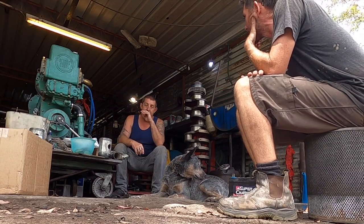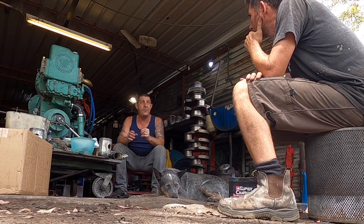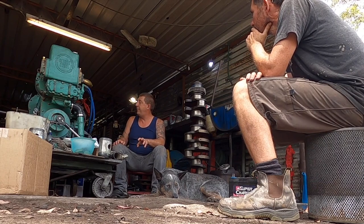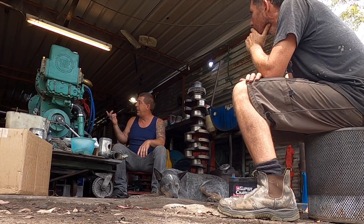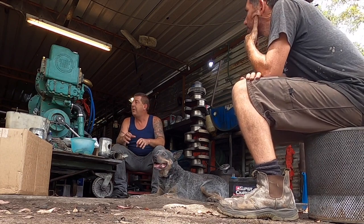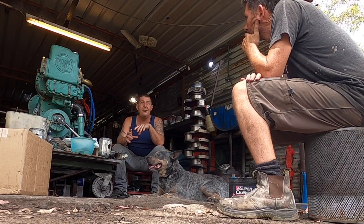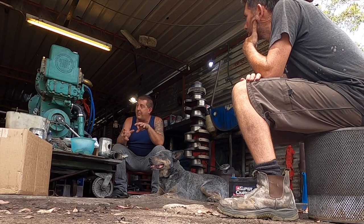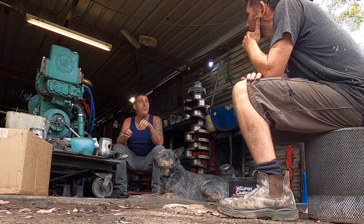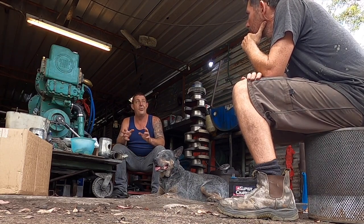So what is involved in changing a Detroit like this to make it turbo? Yeah. You would have to change the pistons, so it's a different compression ratio, different bowl shape. And adjust the blower clearance, so you'd end up with a little bit more clearance on the blower. If you were just going to, for you, I'd probably just leave the N60s in it. Mm-hmm. The turbo would probably just clean up the little bit of unburnt fuel you get from the lack of efficiency, and would make a really nice little efficient engine.